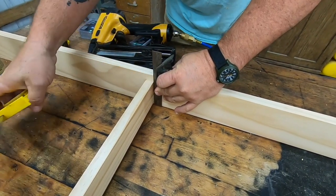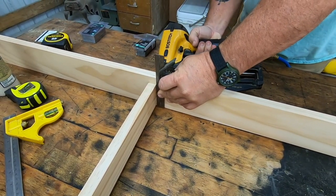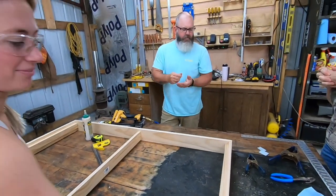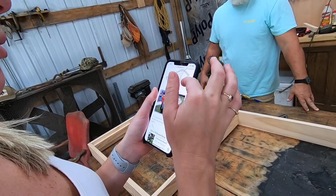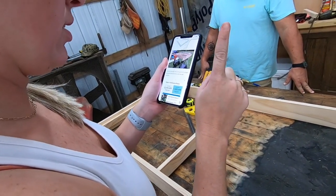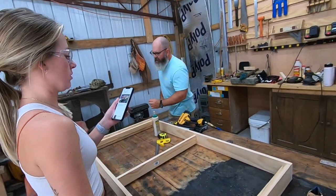It's okay, it's okay, the other boards will cover it up. It's not in the middle — oh well. Next step: those are 52 inches. I did the 1x3 middle. These three pieces will support the board. Then I cut four pieces of the 1x6, fifty and a half inches in length, and glue and nail them onto the seat supports.